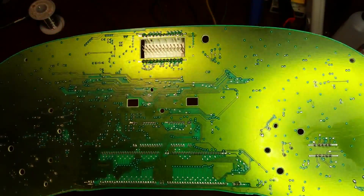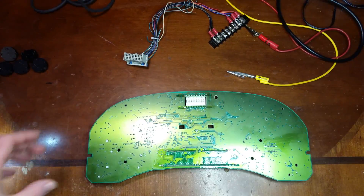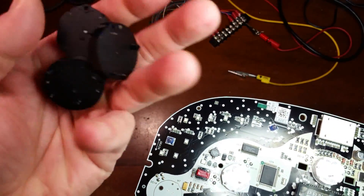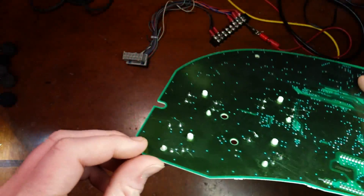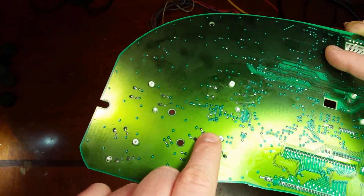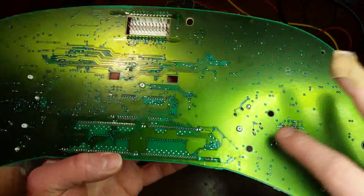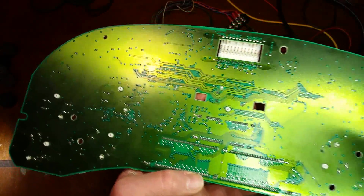I'm going to go ahead and start putting it back together to see what doesn't work and what does. New stepper motors are in — I ended up putting in new X27s. The old black ones are probably okay, but I just didn't feel like dealing with them on this board. Most of the solder joints turned out okay. This side over here was all right. I did need to cheat a little — I added a jumper here for that missing pad. This one also needed a jumper because even though the pad was there, it had broken away. A couple of jumpers here for the RPM and one needed for the miles per hour. The other ones look like they'll hold up okay.